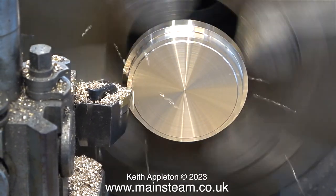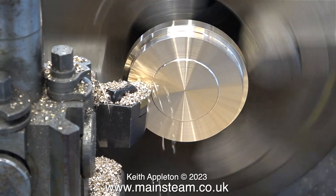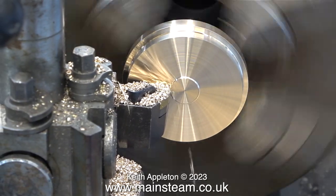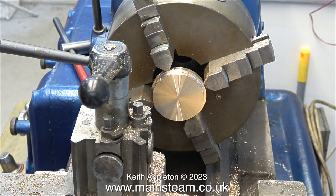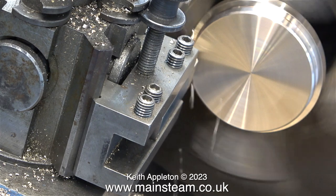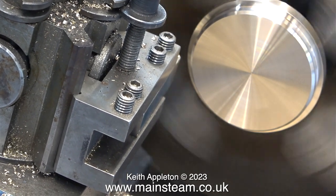While I've been talking about different types of chucks, I've been machining this piece of gunmetal. It's now a really good fit — not a massively tight fit, but a good fit in the top of the piece of copper tube. When I make components that are going to be silver-soldered together, I never make them a really tight fit, because you need some space between the parts for the silver solder to run into. This also applies when using Loctite 603 or any other bonding adhesive. The gap doesn't need to be massive, but it doesn't need to be a piston fit either. Here I'm using a chamfering tool to machine a chamfer on the part of the cap that sits inside the copper tube — not essential, but it's to allow the silver solder somewhere to run to, like a channel all the way around the inside.